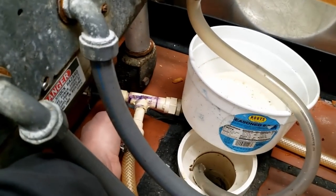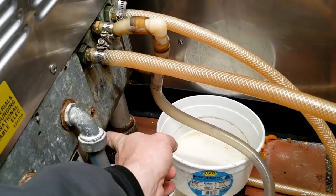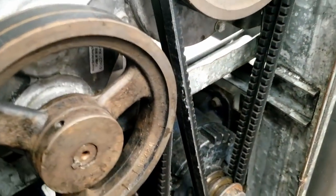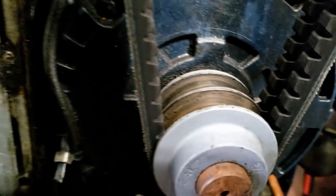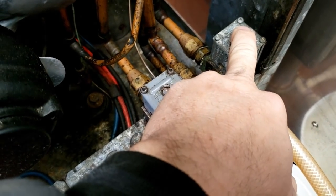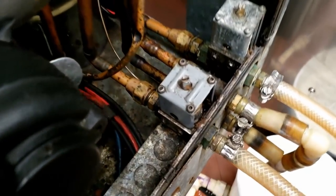I'm seeing what looks like it's leaking out of there, down there — so I need to call the guy and talk to him. There it is, seeping out of that area right there. I'll pop this back off. Those belts are looking a little bit bad but they do their own maintenance on that. There's a nut missing there. Here's a better look at the valves — basically just crank them in or out to adjust your head pressure to maintain whatever head pressure you want. Let's see if we can find out where it's leaking.